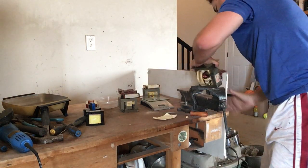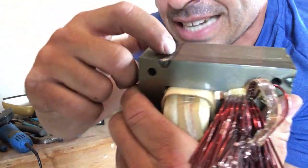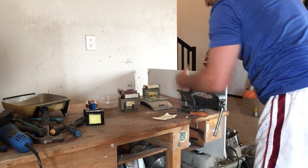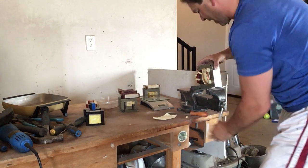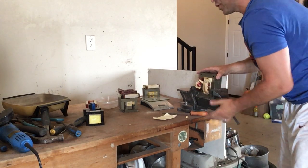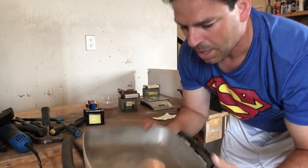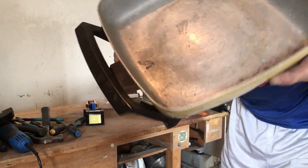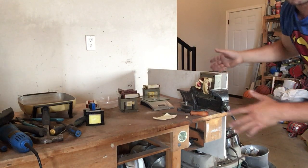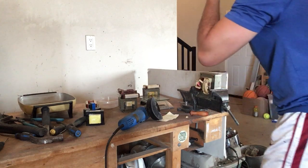So I am going to revert to my method. I'm going to take my angle grinder and make an incision right down there, then use a file — once I open that, this is going to pop off once I use a punch. Word of caution: when using an angle grinder with copper, it does give you some copper dust, so you definitely want to wear eye protection. I'll use a catch basin to catch the copper dust and throw it into my number two pile. But because I'm cutting the weld, I don't want to mix that into my copper.